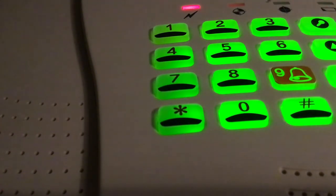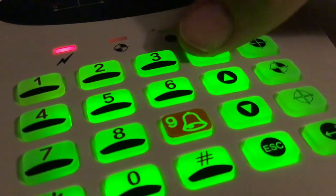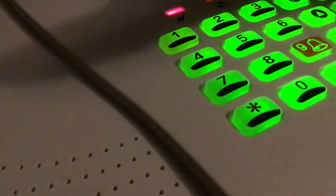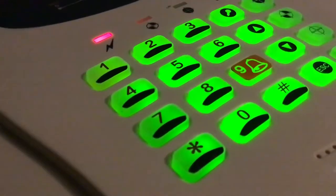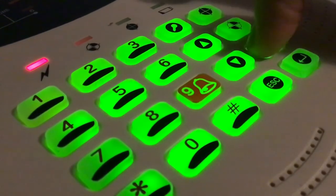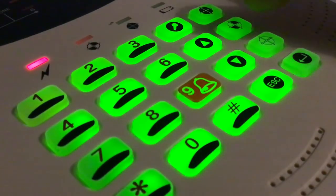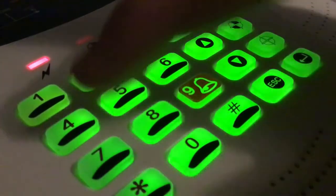Let's reset that and I'll show you the inside. To get into engineer's mode and bypass tamper, it's the unlock key followed by the code - though I've triggered tamper again. Reset, one, two, three, four, enter - then unlock, one, two, three, four, enter. When you press enter those lights light up and those start flashing. Then we can open it and it won't trigger the tamper.